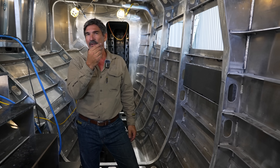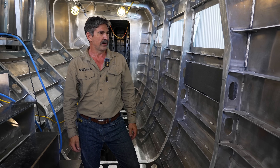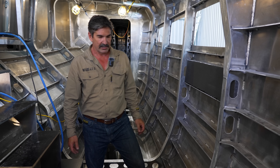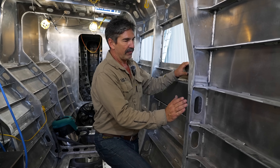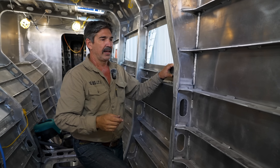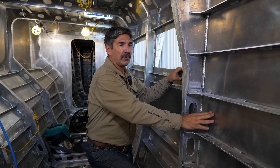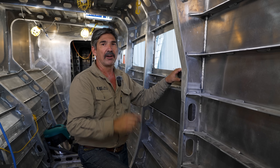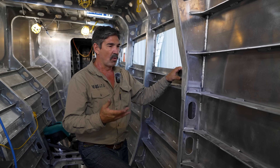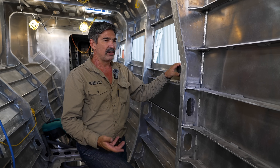I really like the flexibility of being able to pull it off the hull if I want to, so I'm kind of in favor of these ideas. But I've heard that if you have insulation against a metal hull and you get condensation or water behind it with no oxygen present, you can get corrosion. So you either have to allow oxygen in or keep the water and moisture out, and I'm working through ways to do that.